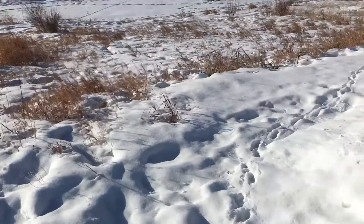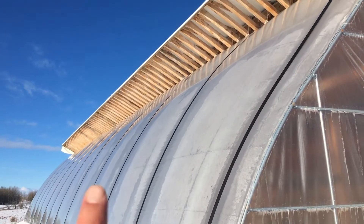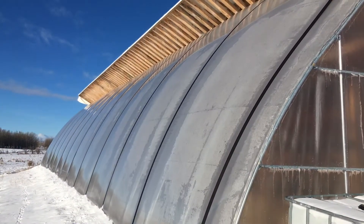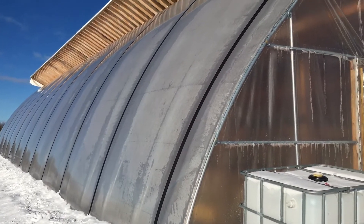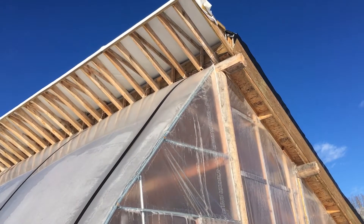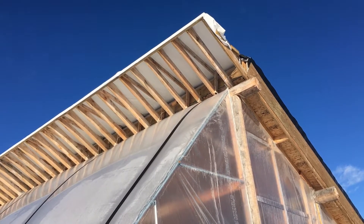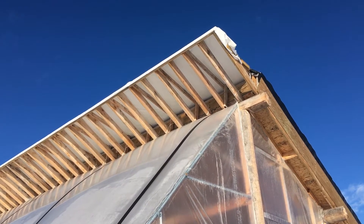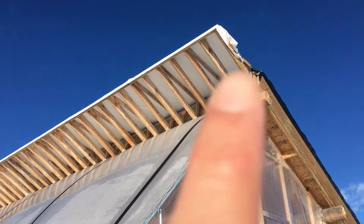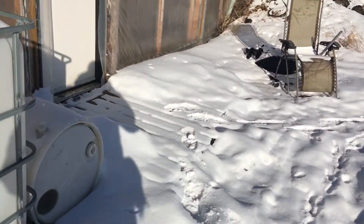Let's have a look outside here before I take you in. I'm going to tie up that loose end of tarp over there, but it's a double-inflated 6-mil polyethylene with UV treatment. In order to have the overhang — which is an architectural feature I wanted — I had to have a temporary roof. So I've got a large X billboard PVC high-quality tarp that I've put on there that I can just roll back when I need to change out the film, which will happen about every five to ten years.